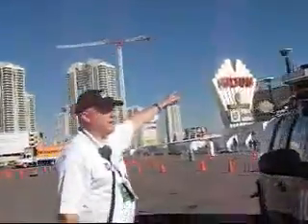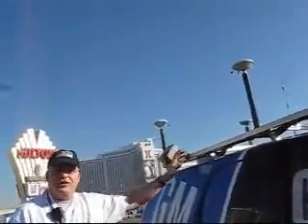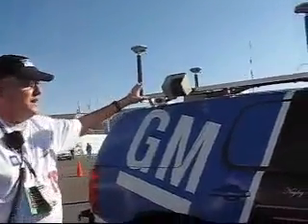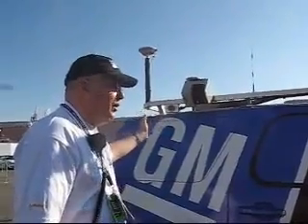Also up on top we have the antennas. These are for bringing in GPS — this is how the robot figures out where it is in the world. It gets its coordinates and basically knows if it's in the United States, Mexico, Canada, or China. It actually gives us pretty good accuracy. If we get into RTK mode it will bring us in, and we'll know where we are within a few inches in the world.